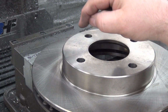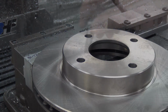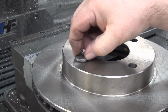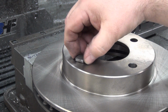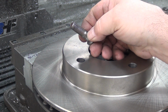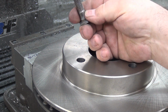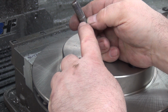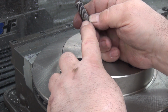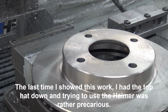It's gonna come in and spot drill the new stud holes, because since it goes over the hub, it's real sloppy on the studs. And about that much of the stud sticks up from underneath, and this is 7/16. This is a little bit bigger. I cut the holes so that it registers very closely to these,